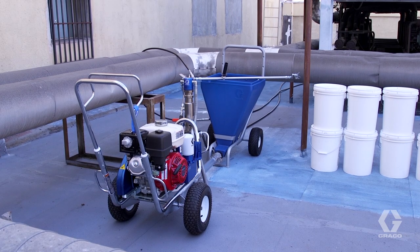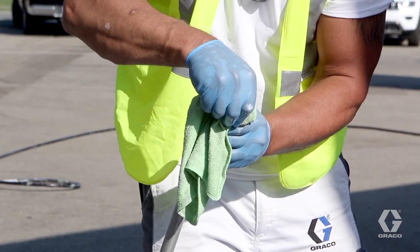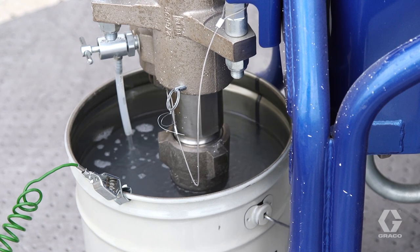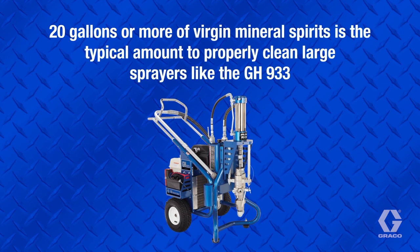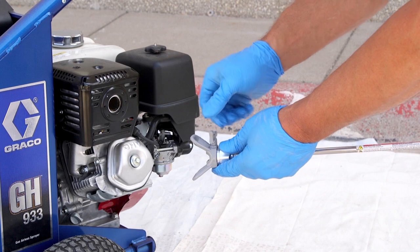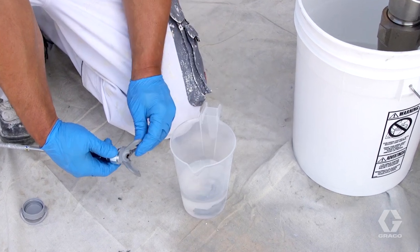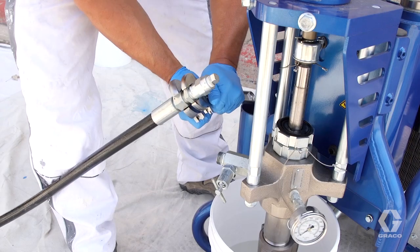Proper cleaning and storage of your equipment is important so it will be ready for your next job. Start by removing material from the equipment, then clean any visibly dirty areas with virgin mineral spirits. Load virgin mineral spirits into the machine and spray the remaining silicone through the pump, hose, and gun. Continue to pump virgin mineral spirits until it runs clear. The amount will depend on hose length, although 20 gallons or more is typical for a large sprayer such as a GH933, and 10 gallons is typical for smaller sprayers such as a DutyMax GH675DI. With the pressure removed from the system, remove the gun and hose sections, keep virgin mineral spirits in the hose, and cap the ends for storage.